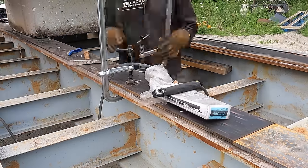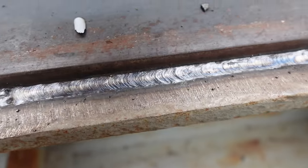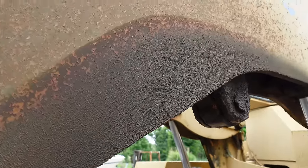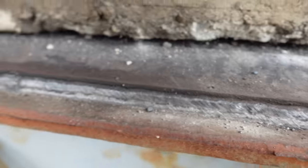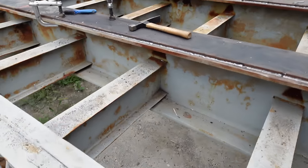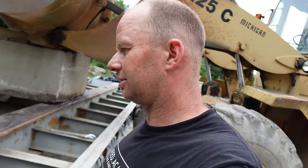Starting from the middle and working our way out, going in circles all the way around, getting bigger and getting better. Those welds are looking really nice. I'm only doing the root pass for now just to get it all tied down, because eventually Phil is going to want his payloader back. These are Vince's triple pass welds - I'll see what my triple pass looks like. I'm really happy with my initial root pass. This is probably one full day to do one pass, but I'll work overtime instead of watching TV and get it done in a day and a half. Big step - then splash paint on it and keep carrying on. Coffee time, keep going after.